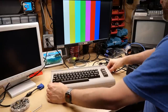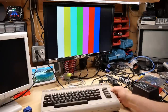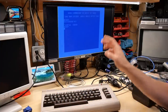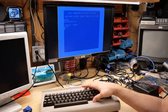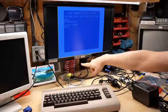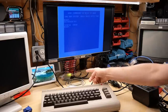Let's test this thing out. I'm going to plug in my newer power supply and my five-pin adapter — the one I originally made for the Commodore VIC-20, since it uses the same pinout as these early 64s. Nothing else plugged in — let's see what happens. Look at that — we have a working 64. It has relatively cruddy video quality, indicative of these early VIC-2 chips. Commodore also used the wrong resistor value on the video output circuitry, which results in a dimmer picture. There are vertical lines that don't look great, but that could be the RetroTINK 2X Pro.